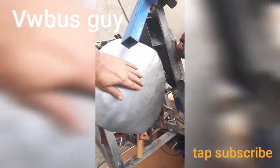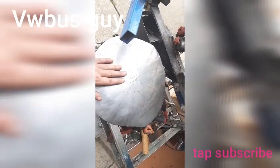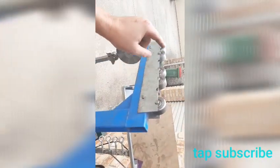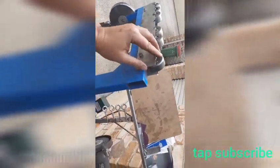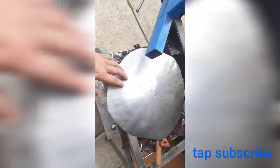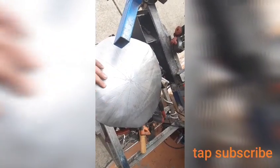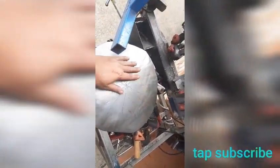So anyway, I'll just continue with this wheel and level it out a bit more, and then work my way up the numbers until I get to this one, which has got rounded corners, so it won't leave any track marks. I mean, remember that this is going to end up being rusty and painted anyway, so I'm not concerning myself with making sure that it's perfectly flat. It's not really what I'm concerned about. So getting the dome and then working all of the ripples out is really what I'm doing now. So anyway, I'll bring you back.